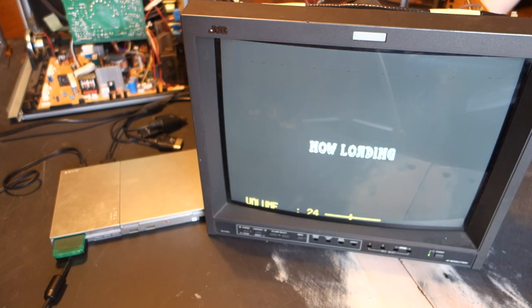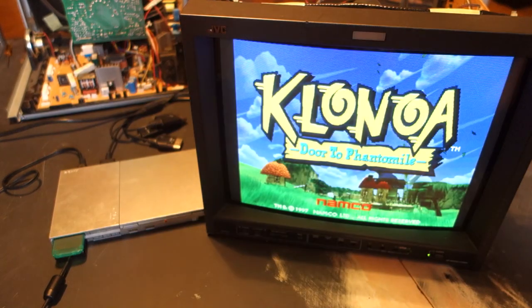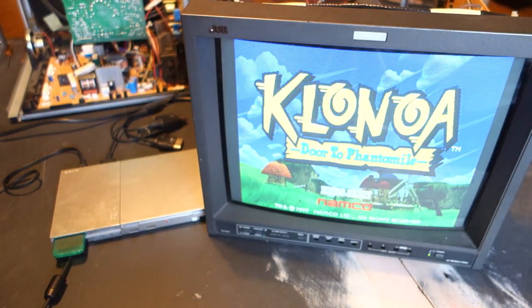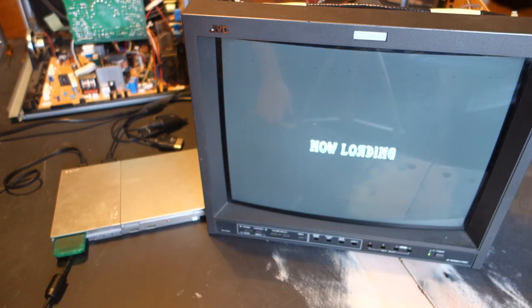This could be due to service menu settings, which likely carried over from the 1900, but I do remember that this set wasn't as bright when I had initially tested it either. A little tweak to the flyback works in a pinch, but I will need to fiddle with the individual cutoff and gain controls later to get it looking a bit more proper.